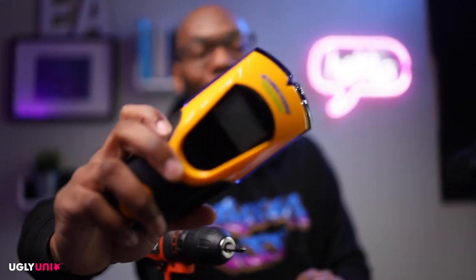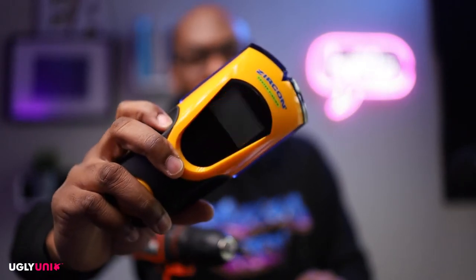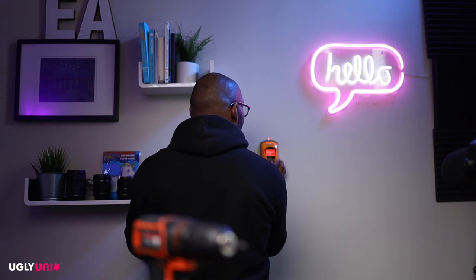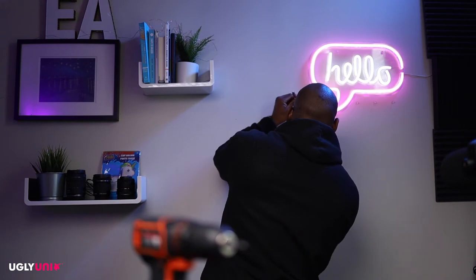Because, hold on. Let me find a stud real quick. Where's my stud finder? Oh, also I have the stud finder here. These are not sponsored. These are just stuff I have around the house. So, stud finder, it also does deep scanning where you don't want to hit an electrical thing, but you just do that. So let me just scan for a stud real quick. And where's my pencil? All right, so that's how you find a stud in the wall. So I think I'm gonna be screwing these screws into the stud there.